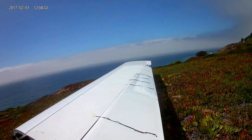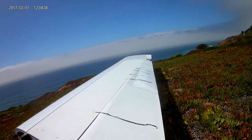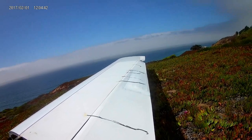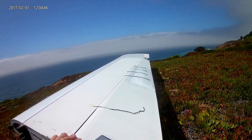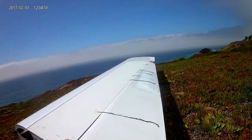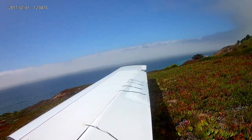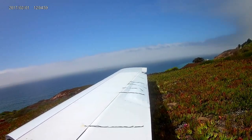Out at the tip, I suspect we're getting bad results on that tuft because the sawhorse is sitting right in front of the leading edge of the wing, obviously disrupting the flow. So I can't say whether that one's right or wrong — it's just wandering around. But looking at the tufts on the lump compared to the tufts inboard, the lump is a significant improvement.